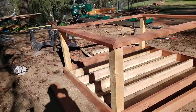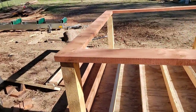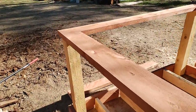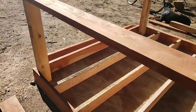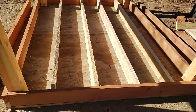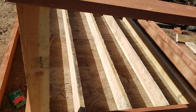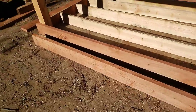I just thought I would show how this has been taken care of and coming along. It really is nice. This is a redwood base — I wanted to have it as a platform because it's better in the dirt. Then I need to get some joist hangers for these Douglas fir pieces — five and a half inches by one and a half inches actually — that I cut.